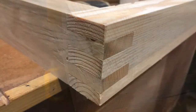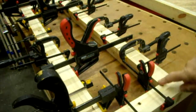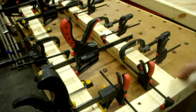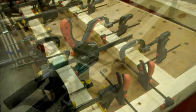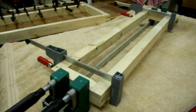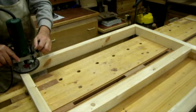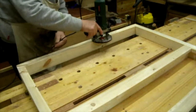They don't look too bad. I've just mitered some battens and glued them to the top of the frame to act as a stop for the opening window. This is the opening window — same process as the frame; I've used bridle joints at the corners. Now we need to get it to fit and work. Rebates are required for the glass panel to sit in, using a rebating bit in the router for this — a few passes required to get to the right depth.